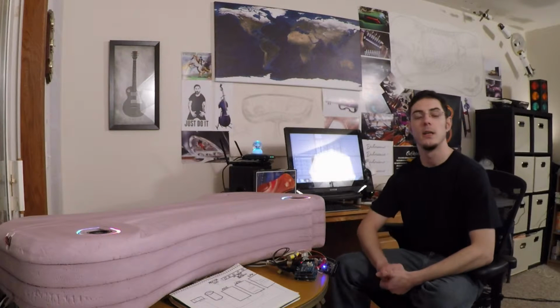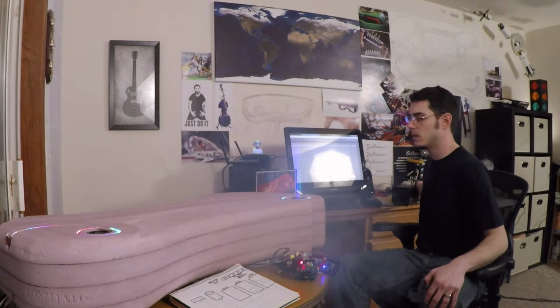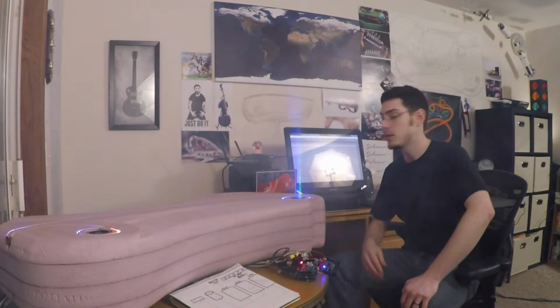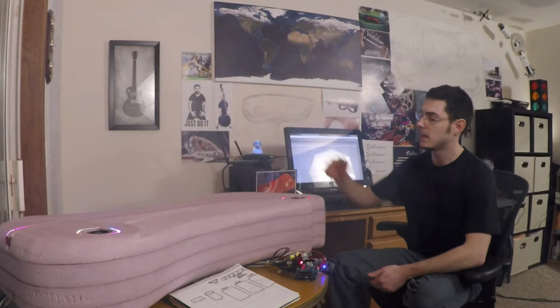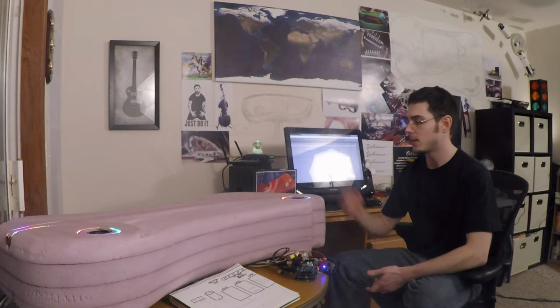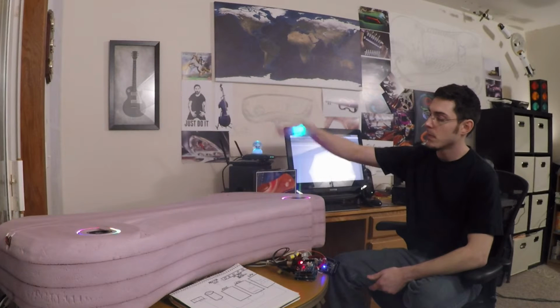As you can hear, it's kind of playing on its own right now. Our effects concept of being able to see you play these beams is critical to be able to have some haze or some smoke in the environment, but as you can see, I'm getting a lot of misfires into the fog. It's thinking that my hand is over the top of it now. As it sees the fog and its own reflection, the infrared light is scattering back to the sensor due to this haze in the air.